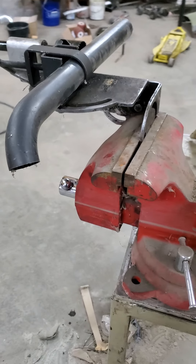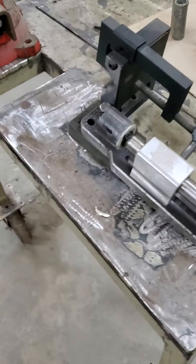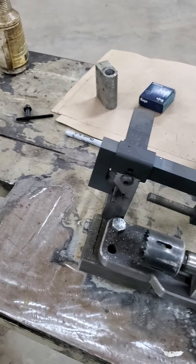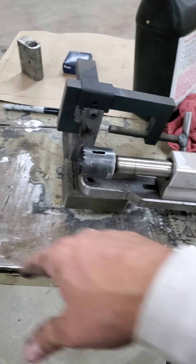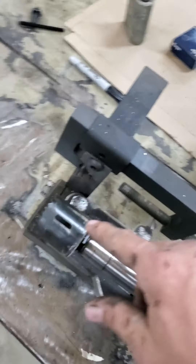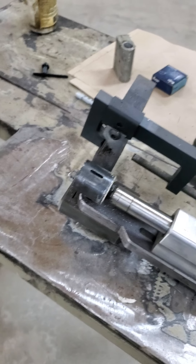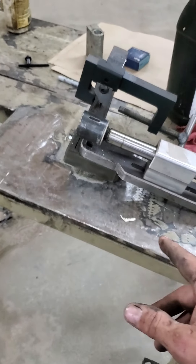That's the gist of what I've got on the cheap ones. I was going to show my JD Tools notcher but I haven't done much with it since I got it. I got it with all the swag accessories they sell for it and it really is a sweet piece — super rigid. The clamp moves and clamps super close to the end of your tube, cuts from 180 degrees so you can do literally any angle. I've also got a 'goat' attachment that lets you clamp on a curve, which is handy. The swag stuff really took it to the next level.